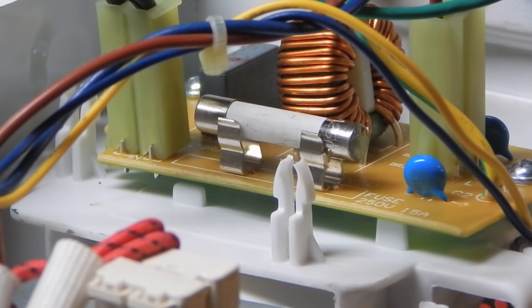Here's something you definitely don't want to do. That's an AGC-sized fuse - 15 amp is the correct amperage, but it's an AGC size and I've just got it basically forced into the small holder, making just enough contact so it should run. I obviously won't live with that, but I just want to see whether or not the thing will work. If this blows, I know I've got a bad component in the high voltage section and it's just not going to be worth repairing. As opposed to if everything else is normal, then I can assume there was just a power surge that caused the fuse to blow, and I can either get the proper size fuse or just solder it right in there.